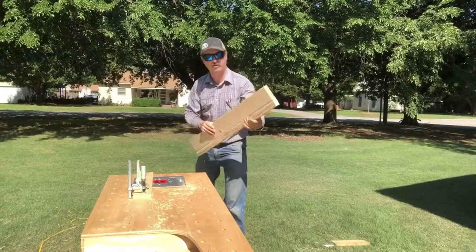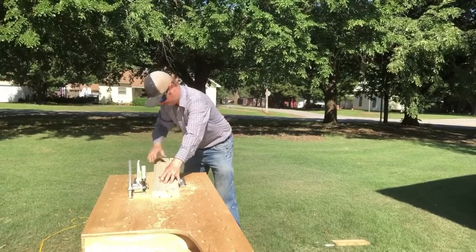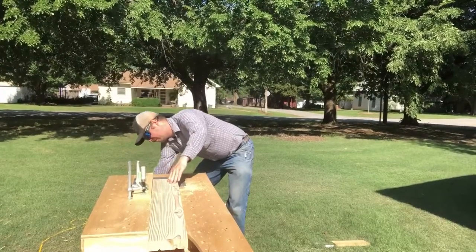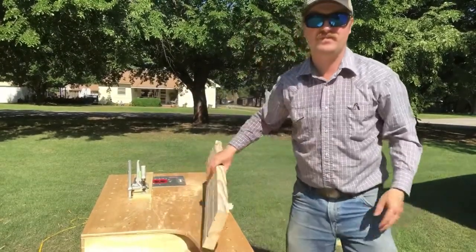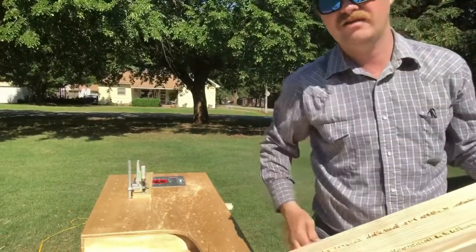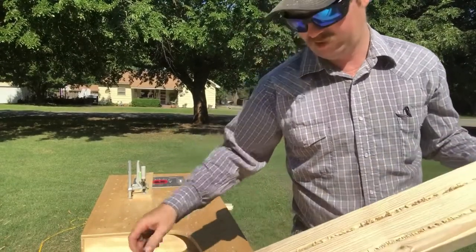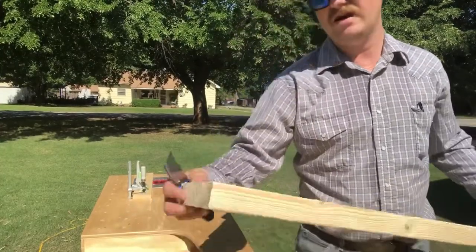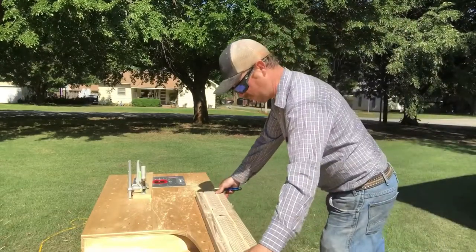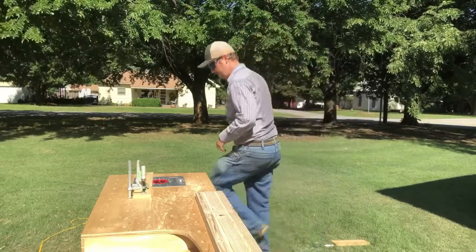All you do is flip it around - we've got our V on that side. You'll have to clean this up with a razor blade generally; those pointed bits, that's just the way it is. Run your razor blade in like that and the groove will clean right out. Now you have two nice grooves in the back to provide a little stress relief as well - that's how they make door casings and everything. It keeps it from cupping and bowing a little bit.